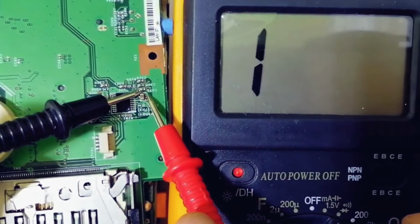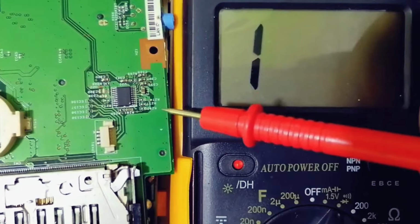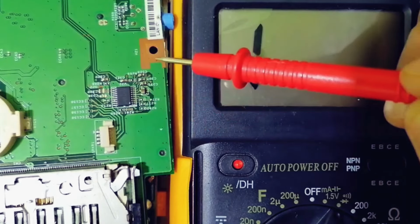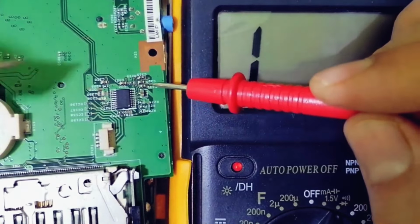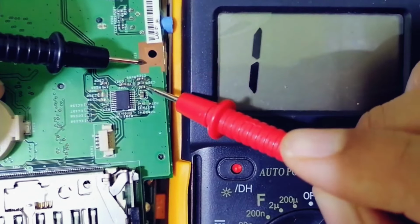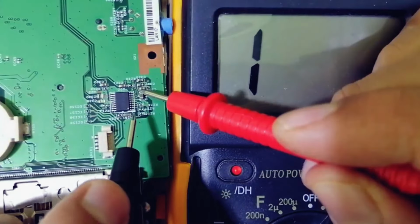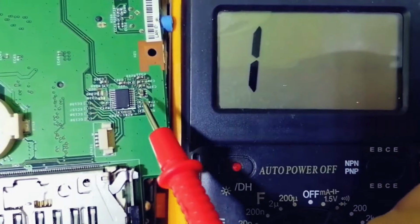Because we have this path over here connected to ground. This is ground basically. So all capacitors around the IC, you will find it connected to the IC on one side and to the ground on the other side. Let's check this one for example. This ceramic capacitor also, as you can see, this pin is connected to the ground, as you can see in this terminal, and this terminal of this capacitor is connected to the IC over here, as you can see. Do you see the path?